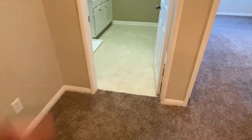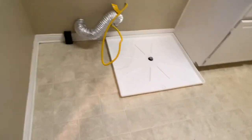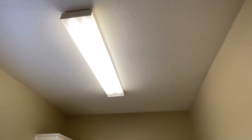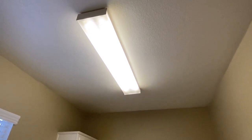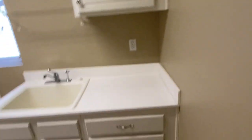Moving into the laundry room — one of the better rooms of the house. Here's a general overview. First, moving in, there's a nice bright fluorescent light that's humming, so the ballast is humming. If you can hear it — I'll be quiet for a second — the ballast probably needs repair. If that were the case, I'd contact you guys and probably switch that out to an LED. It'd feel a lot less harsh in here.